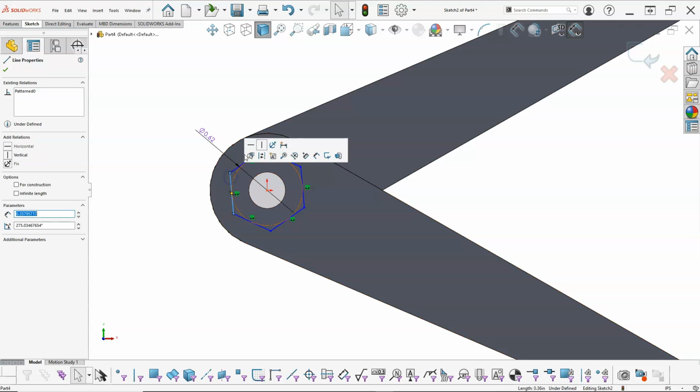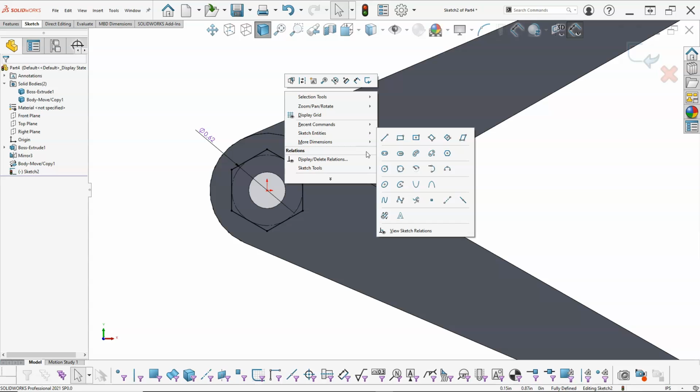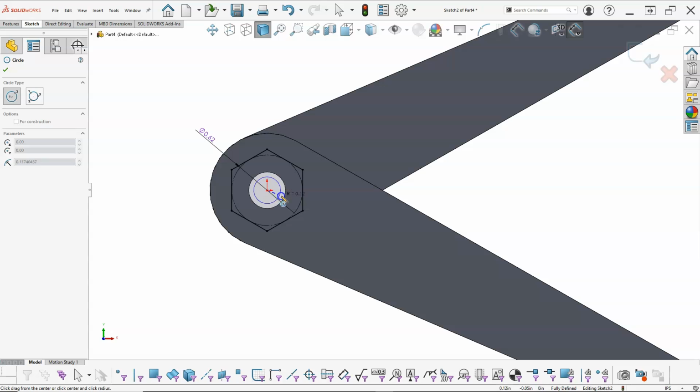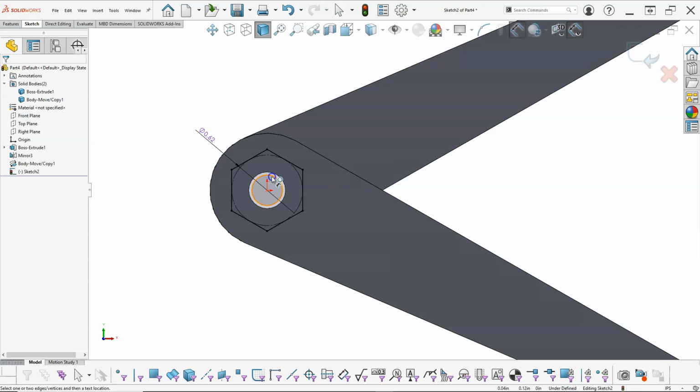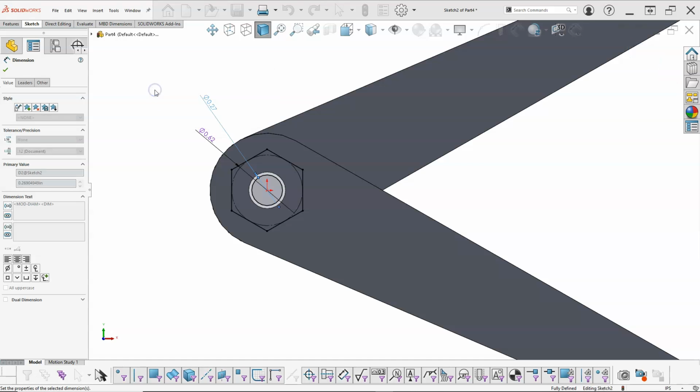So I can come over to geometry. We'll make that a vertical. And then typically that's going to, let's say that's going to be a 5/16 18 if we're actually doing a fastener. So let's go ahead and put in for our circle, the 0.32 will be the clearance. And so we need to pull up the drill chart, but 257 for a 5/16 18.